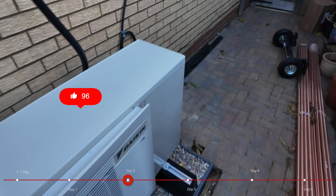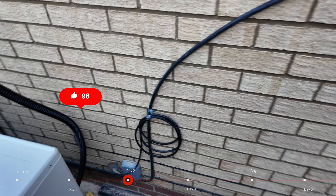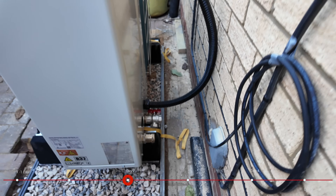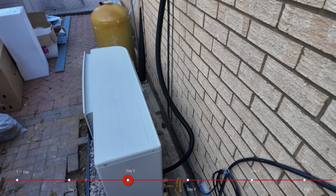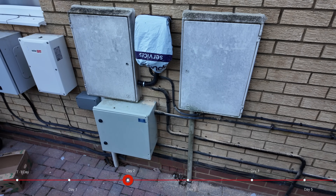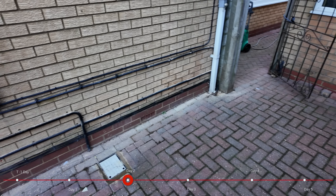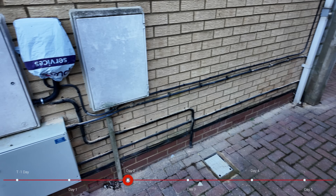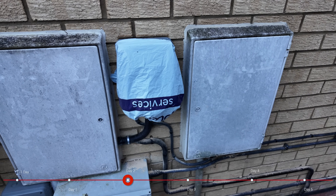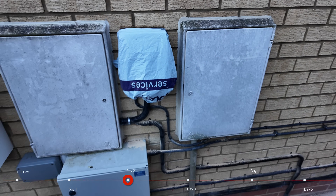Let's head around to the other side of the heat pump — you can see where the two pipes will come out, and again they will just run following that duct straight up the wall, giving us our hot and cold returns. The electrical wiring is all now in place and the consumer unit is underneath a plastic bag so it doesn't get wet overnight. The electrician has got all of the cabling into place and that will all get livened up once the heat pump has been commissioned.